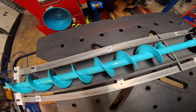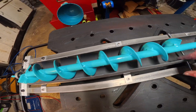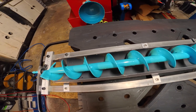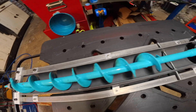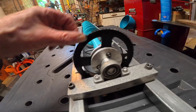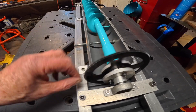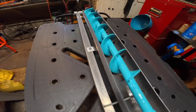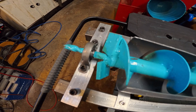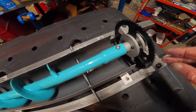The principle is pretty good: water comes in and is screwed down the shaft and exits at the bottom. It's in an open frame with a duct that channels the water around the screw. It's a good idea but really not very powerful. The problem at present is that the water egress is either blocked by the cog, which is going to be hooked up to a generator, or at the other end, which has blades to drill into the ground — and that blocks the water going up the ducted channel.